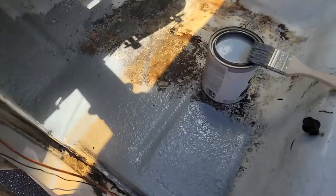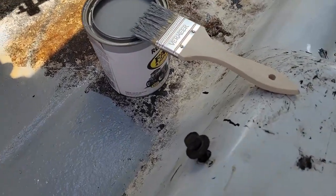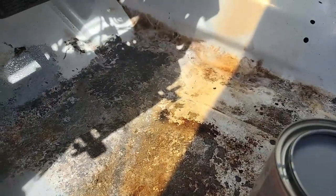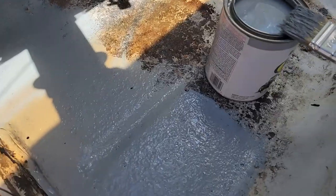Little update. You can still see that patch there but it's going to be hidden underneath — it's all solid now. Throwing on some of this Rust-Oleum farm implement gray primer — it's a rust inhibitor. A lot of farmers and heavy equipment guys swear by it. It prevents rust. You can see the rust kill killed all that rust and turned it black. The little rust color remaining is from rinsing it out with water — having a little flash rust — and this will stop it. Get this all sealed up nice with gray primer, then I've got white to go over it, so it'll all be nice and white and should prevent it from rusting any further.